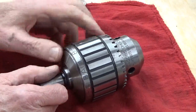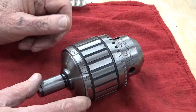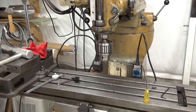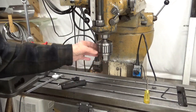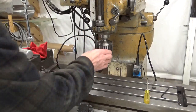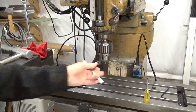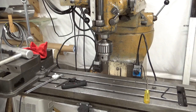I think this thing is going to help me a lot with power tapping, because with the ball bearing chuck we'll be able to tighten it up better on the taps and hopefully get a better grip and have more success with power tapping. I've got the chuck in my Bridgeport vertical mill now, and it runs smoothly through its whole range of sizes. The chuck key fits fine in there now, so I'm happy with that. I wanted to look at one more thing though - what the run-out looks like on the chuck.